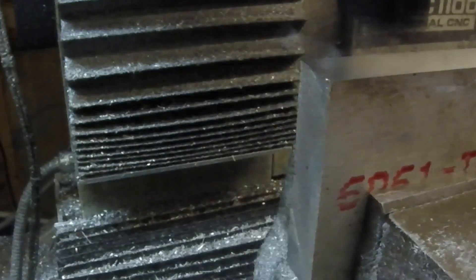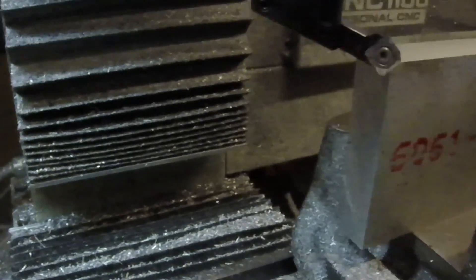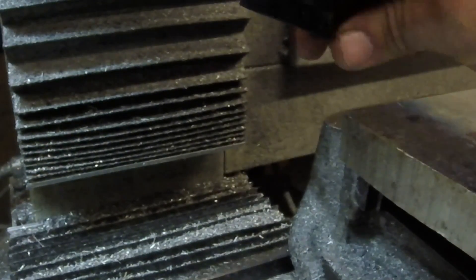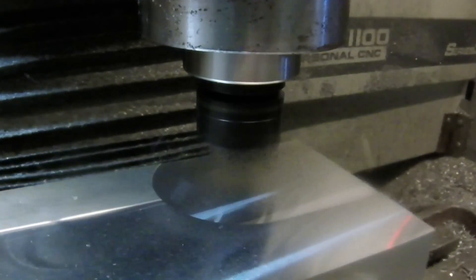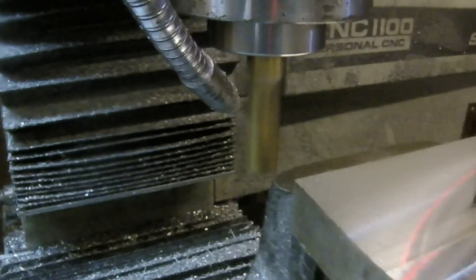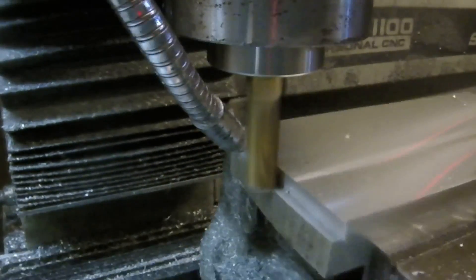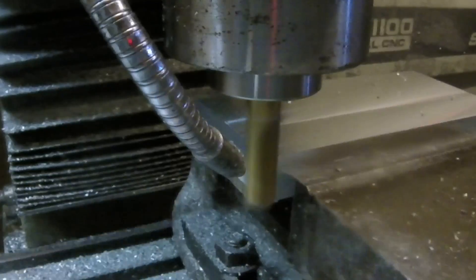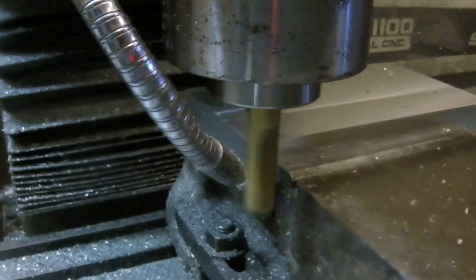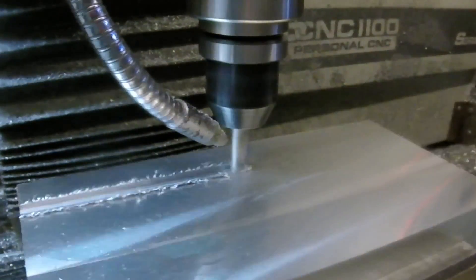Taking the superfly, I'm going to cut it closer to size while squaring off the end. The superfly really gives a nice finish. We'll repeat on the other side, then take a face cut with the superfly as well. Now squaring the ends — I don't typically use a four flute on aluminum, but I used one in a pinch recently and it worked out pretty good, same results, good smooth finish. Repeat for the other side.